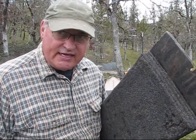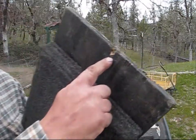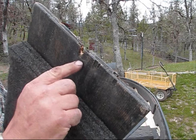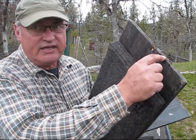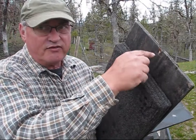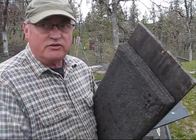First of all, this seat keeps coming off because the original hole drilled in here, you can see where it's torn off. So I'm going to either re-drill a hole next to it or put a steel bracket in there and tap a hole big enough for the pins to go through and hold this in place. And so that bracket will be screwed in there, so the seat won't keep coming off.